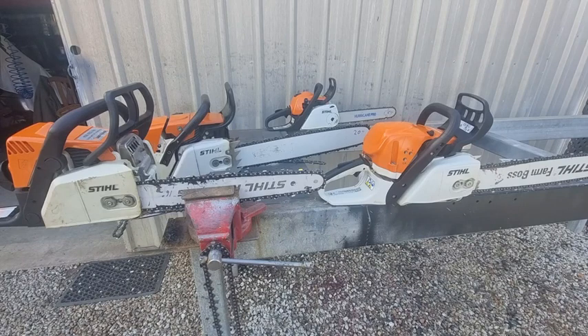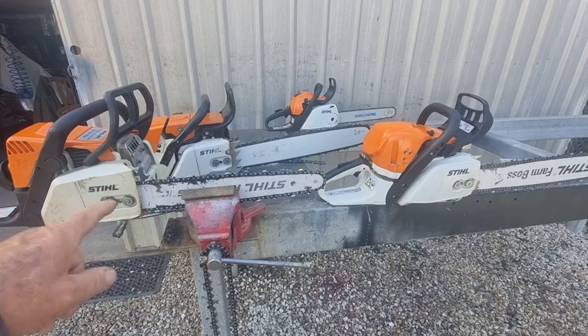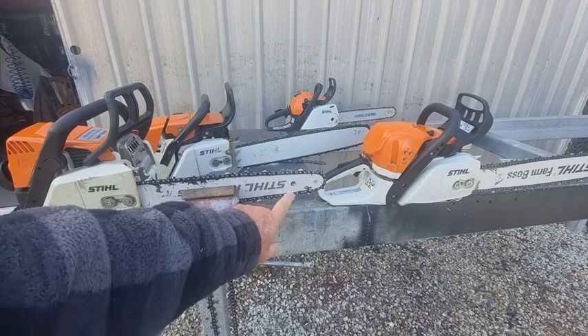What I'd like to talk about is upgrading your chainsaw to a larger bar. You've got to have a good reason to do it. In front of us here, I upgraded this to a 16-inch bar — it's an MS 170 that comes brand new with a 14-inch bar. I put a 16-inch bar on it, not to cut bigger logs, but to get into tighter positions with an extra two inches of reach.